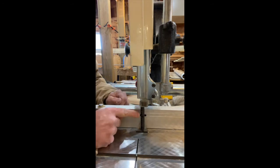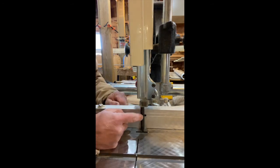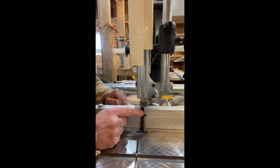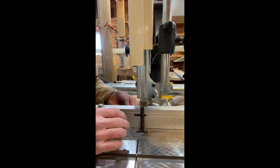I've got that adjusted where I want it, and the actual edge is probably at the very back end of the teeth as I've set that up. I am running a quarter-inch hook in terms of the teeth setup. I would much rather run a three-quarter-inch blade or one of my resaw blades. However, that is hooked into a dust collection system, and this particular bandsaw is not.